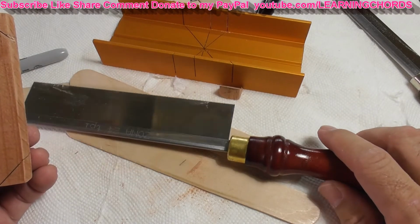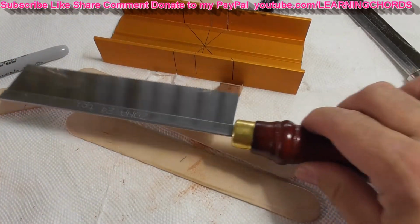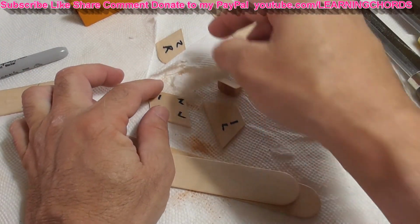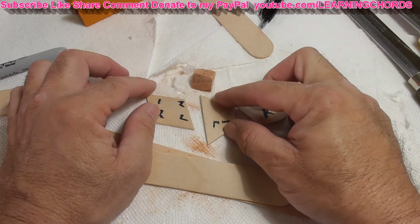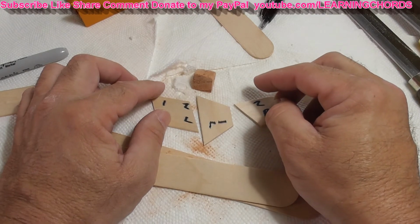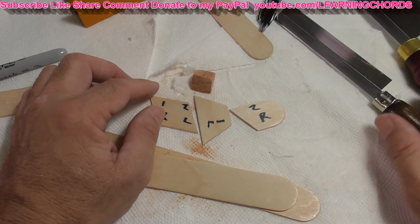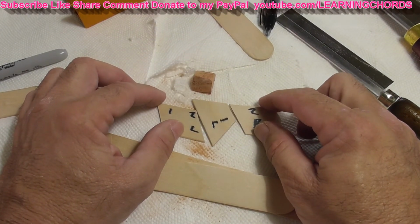And the neat thing is, even if you're not going to use the miter box, all I did is I used this triangle, and I marked my lines over here. I marked my lines, and these cuts are absolutely amazing. 60-degree cuts. So if you're working on some serious 3/4 inch walnut or something, 3/4 inch whatever, and that's what I'm going to be working on, 3/4 inch squared wood, you're going to have a bit of a tough time with it. The nice thing is that if you use these, you're going to be able to get your angles and your saw cuts, and just take your time, be patient, and you're going to get a project.